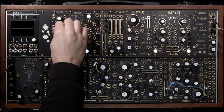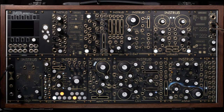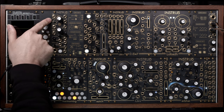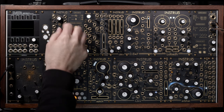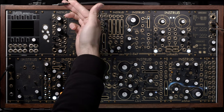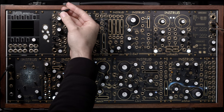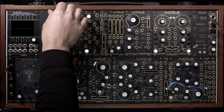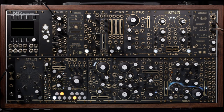Let's dive into this module. I'll start from the top down, as that seems to make sense. At the very top we have a stereo line-in to modular gain stage, or a preamp. This is designed for 3.5mm stereo audio sources — that could come from a phone or any consumer or pro-level gear that has a headphone output.